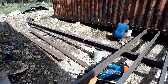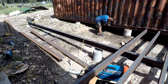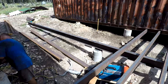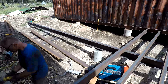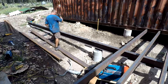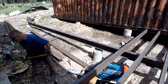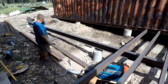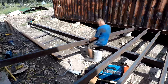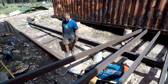Here I'm grinding away the paint and debris on the container so we can weld the C-channels in place. Again, each channel is a custom length measured with the electric measuring tool, then we shove the C-channels in place and weld them up. A little persuasion with a hammer to straighten out some dings on the container lips so the C-channel can slide in. Each C-channel has a small detent in it to slip over the bottom lip of the container.